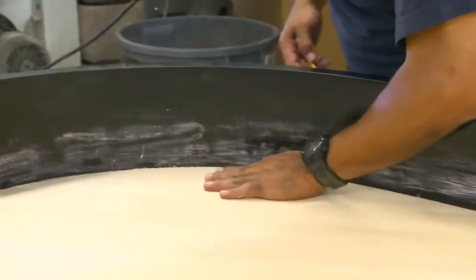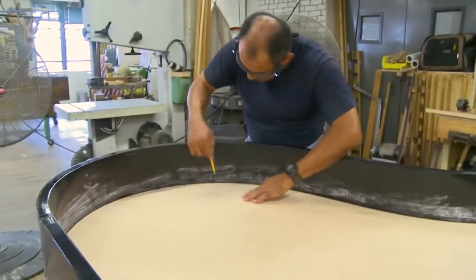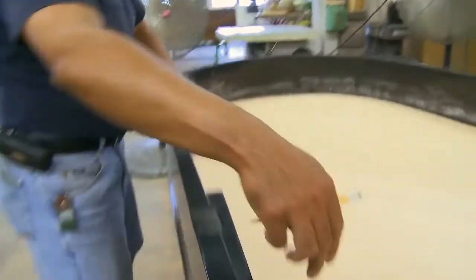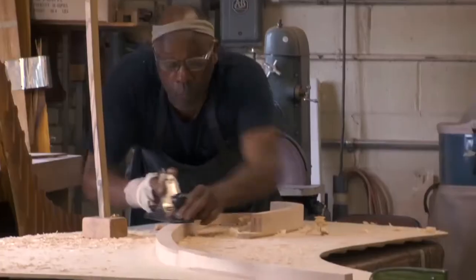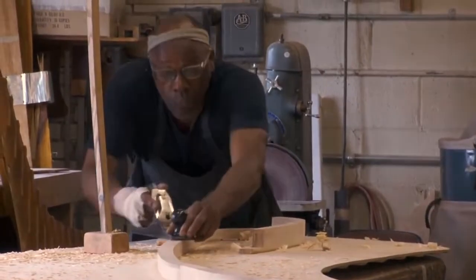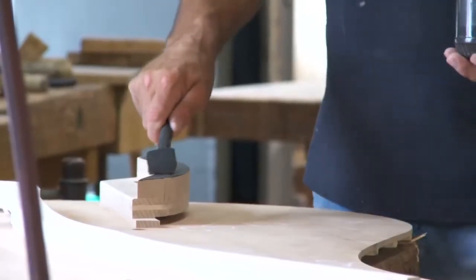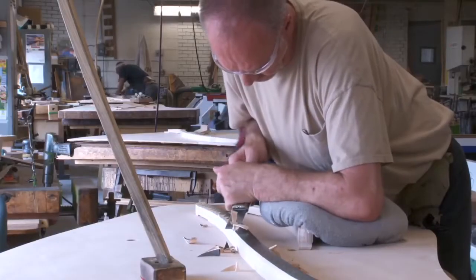To the native properties of the wood, we add an exclusive and distinctive feature: our famous diaphragmatic taper. It is fitted into the piano slightly crowned. This allows vibrations to travel freely along the grain to the center, moving more air, increasing the sound, and projecting it. The bridge, glued to the top of the soundboard, is made of vertical laminated maple just like the grand rim, and transmits vibrational energy from the strings to the soundboard.